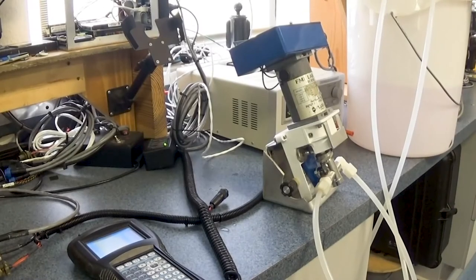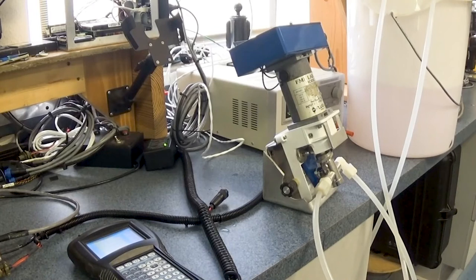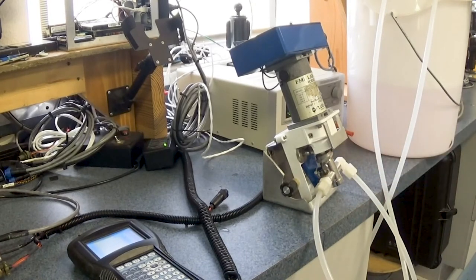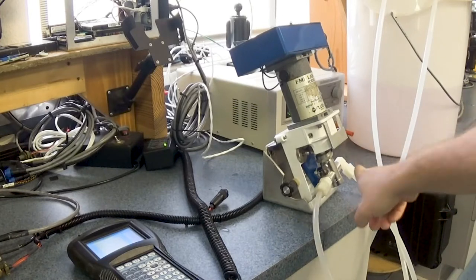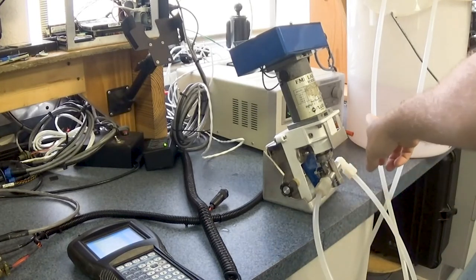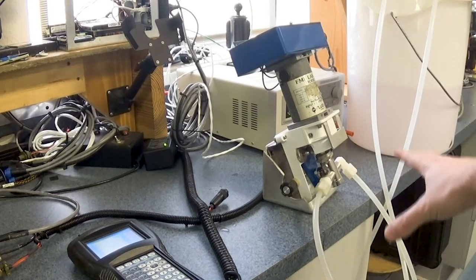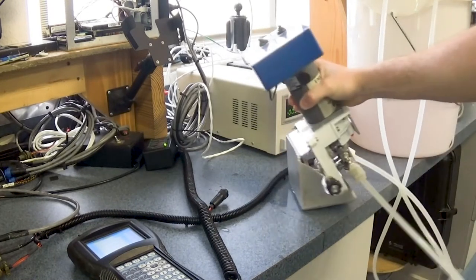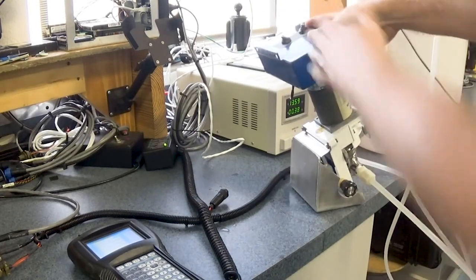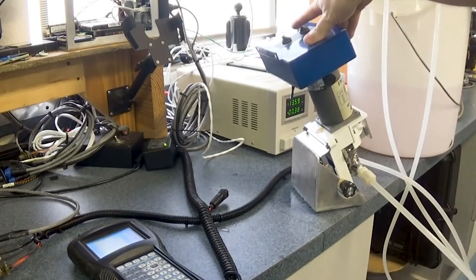All right, so here we're going to calibrate a Monitor 4/Monitor 4S style variable flow pump. Once we have everything straight with getting the swing arm to a position that we'd like, remembering that the direction this is angled towards is the direction that the flow goes out, we just make sure the pump is set to override, which it already is.